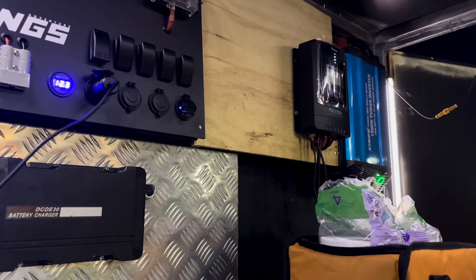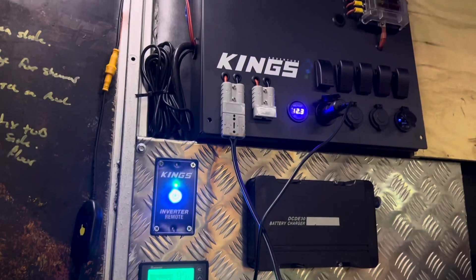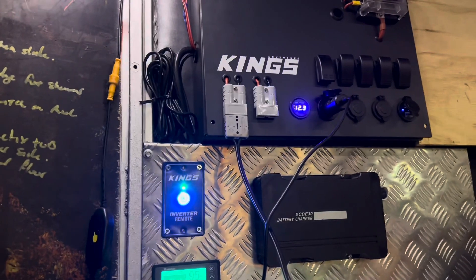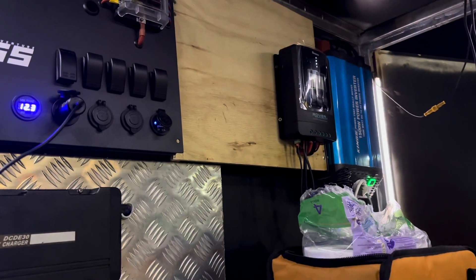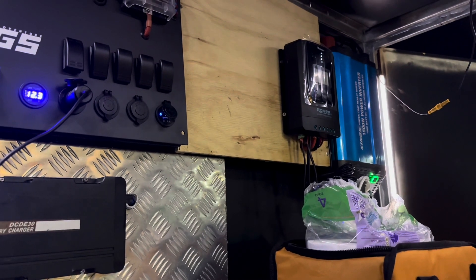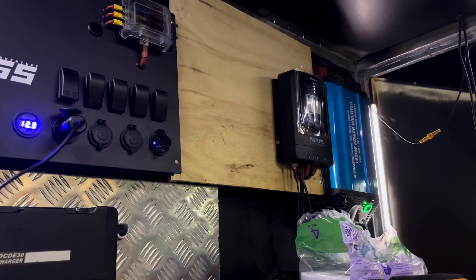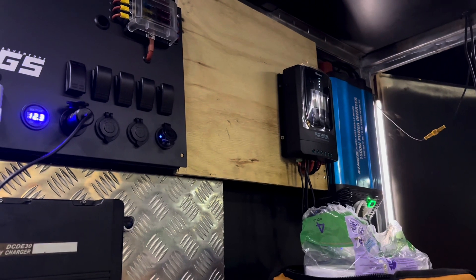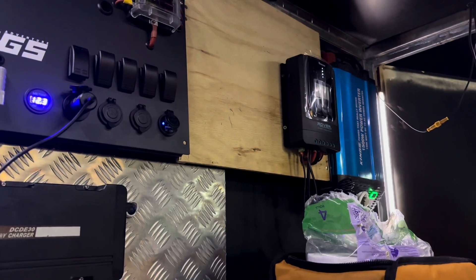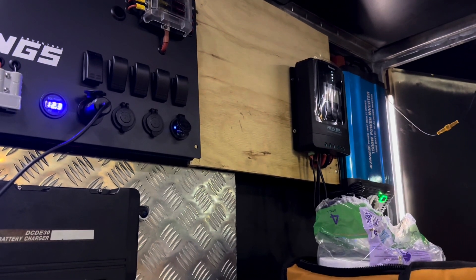The battery monitor — the smart shunt — has a low voltage disconnect, and so does the fridge. What I'm thinking now is that it's actually the load positive and negative on the MPPT causing the issue. I changed the location of the solar panel ground but hadn't changed the location of the load. So I'll undo the ground on the load and the positive on the load and see if it still trips.